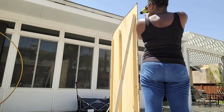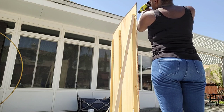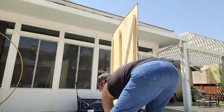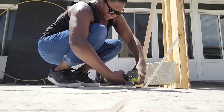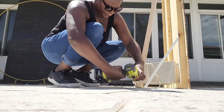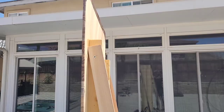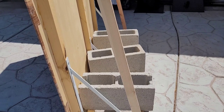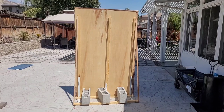First I'm pre-drilling a hole into the two-by-one inch strip, then screwing it into the pre-drilled hole. Here's a close-up view — pre-drilling the hole in the strip, then putting the screw in and driving it in. This is how the strip looks once it's attached. On the back of the board I'm using three cinder blocks, about 15 pounds each, so that's about 45 pounds of weight total.